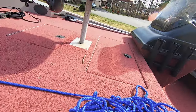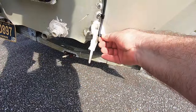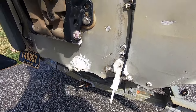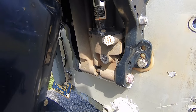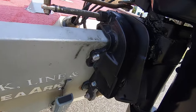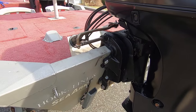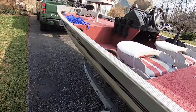The boat seems to be in working order except for the speedometer pickup tube — as you can see the tube broke off from the actual pickup. I already have a replacement so I'm going to reconnect it and it should be fine. For hydraulics it's nice and dry, no oil dripping whatsoever. All the connections are greased up and look like they've been taken care of, though I need to clean up and put fresh grease there. There's also the transducer for the fish finder.